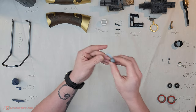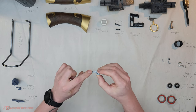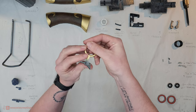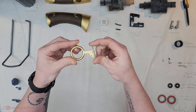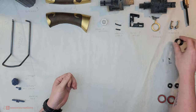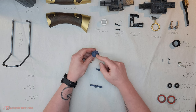Hammers were also printed like this — it means there's overhang on this side, but there'd be overhang on the outside, which is the visible side, if you printed them the other way around. This piece was printed on its flat face because it has a slight overhang, and you wouldn't want to print it the other way because then you'd have tons of support material all around. These small pieces were printed with DLP — they're resin printed.